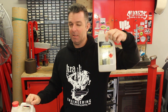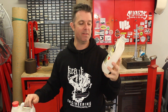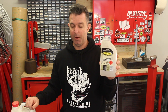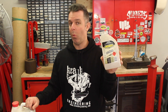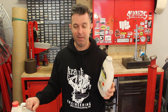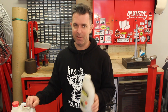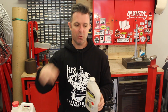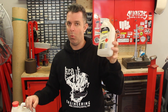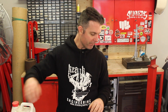For cleaning prior to welding, acetone is my go-to. Don't use this on painted surfaces — acetone is the same stuff in nail polish remover and it will take paint off. If you need to clean a painted surface, use a wax and grease remover. For welding, especially TIG, you really should have some acetone handy. I buy it in a four-litre container and decant it into a small container for use around the shop. Highly flammable — put the lid on before you start welding.